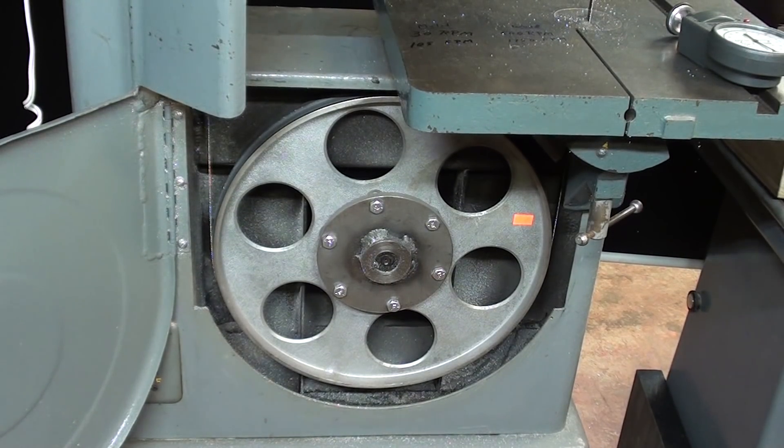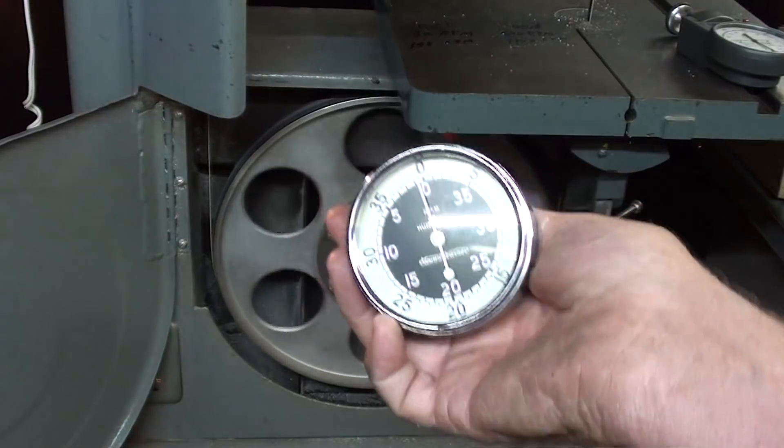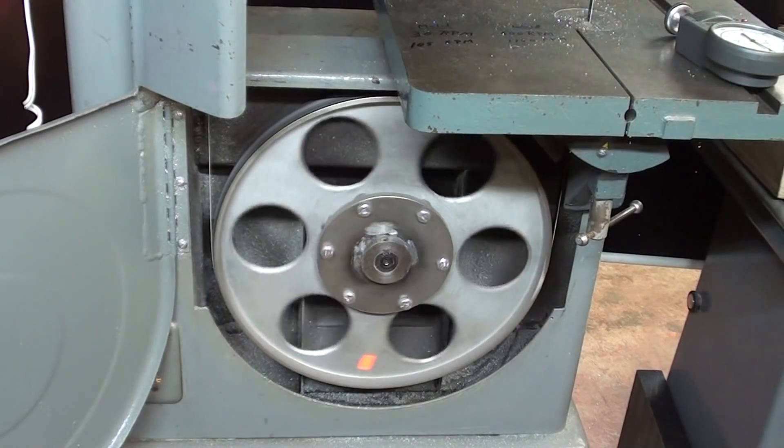That cutting speed of 105 feet per minute is just perfect for cutting steel. I've talked about that in the past — 100 feet per minute is really a good speed for a drill press, lathe, or whatever, for steel. I use this saw mainly for steel, but I sometimes have to speed it up for aluminum. The high speed is really a little bit too high. Now another way of determining RPM and then converting to feet is with a manual tachometer. This machine runs so slowly that you can't take a reading off the shaft — it doesn't even register. So I put that red mark on there and just counted it with a stopwatch.